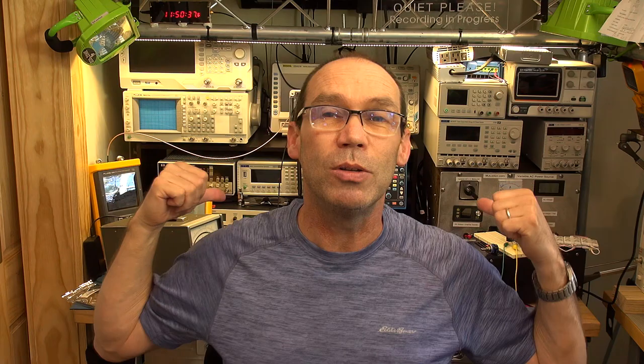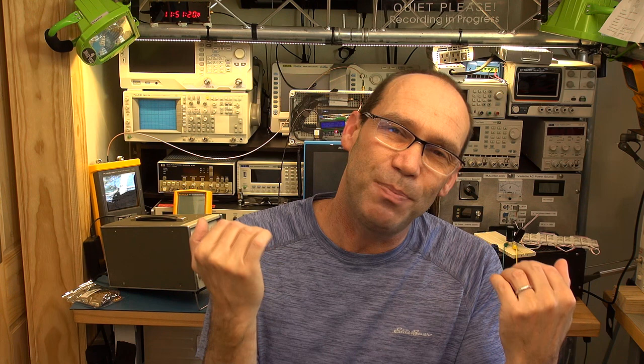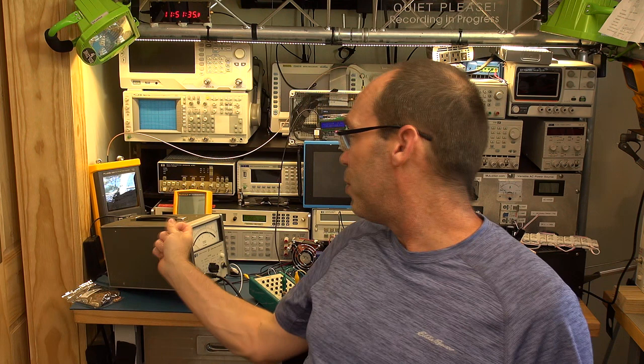Getting onto the college power supply - this is kind of going to be part B of when I did the PCB and put the components on to show it working. At the time when I tested it, it worked functionally. I had to troubleshoot one issue where one transistor's pinout was the wrong way around. Then I decided to measure the output noise, thinking that by going to the PCB I was potentially going to remedy that issue. But when I fired up and put an oscilloscope on it, plus my HP RMS voltmeter - there was the noise. I then checked my original college power supply and lo and behold it does the same thing, so there's a flaw in the original design.